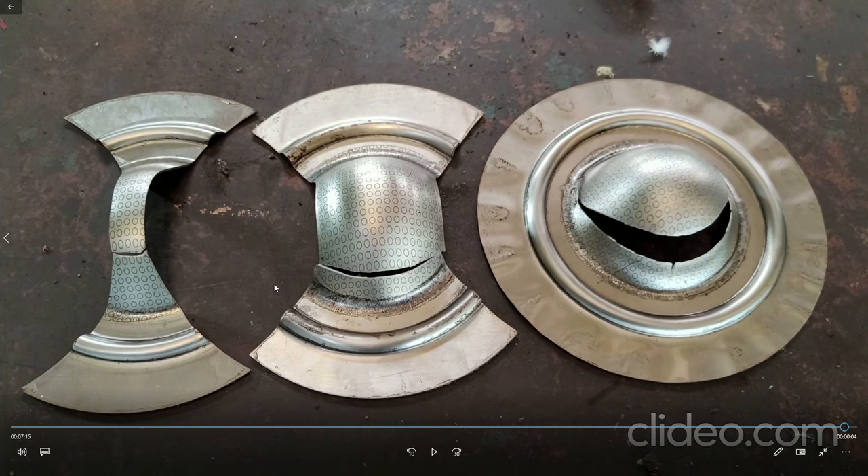This limiting dome height test is conducted in a hydraulic press: the first action clamps the sheet and the second action is the punch deforming the sheet up to fracture. In deep drawing it was demonstrated in a simple UTM, but this stretching demonstration is done in a hydraulic press. The only difference is that in the UTM a mechanical clamping method is needed, whereas here it is hydraulically clamped. This way one can develop the forming limit curve, and we have demonstrated deep drawing and sheet bending operations. With this we stop this video demonstration. Thank you.